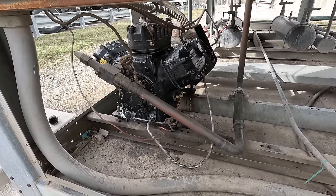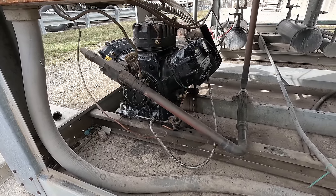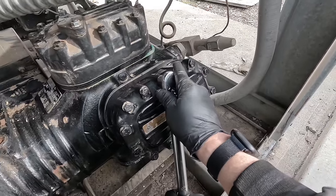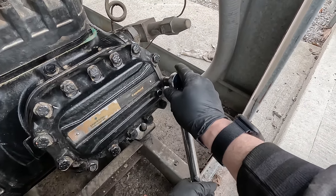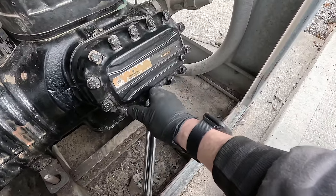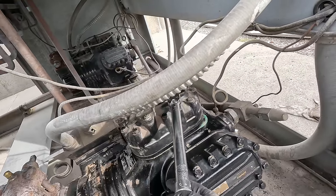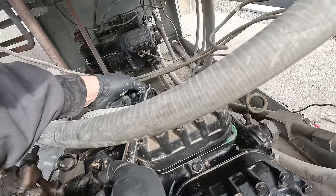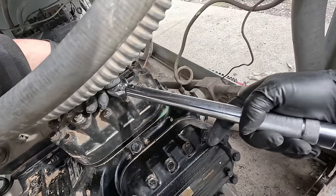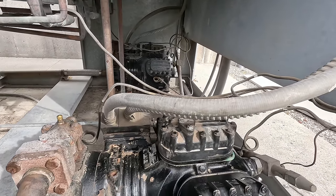It's probably crap in the gasket now - it's probably too late - but we can put new head gaskets on it. The bottom piece can be done, but that would require yanking it out, flipping it upside down and redoing that. Copeland's real close to my area. I got a hold of Trevor Matthews to ask him, since he worked for Copeland/Emerson, to see if he knew what the correct torque was. Looking at the Emerson bulletin - cylinder head bolts, they are Grade 8s, rated in inch-pounds. Depending on the model, there are 300s and 500s. Let me see what this thing is - maybe we can see it on this other compressor tag.